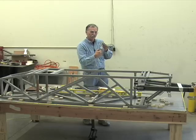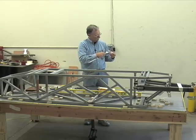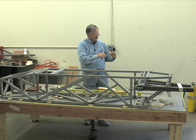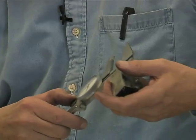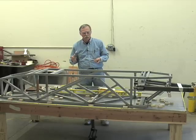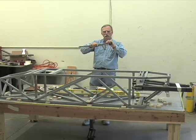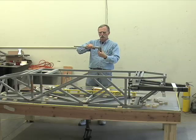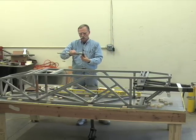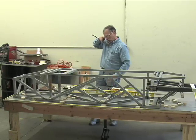So the idea of that is 0.906 inch. If you pull this back and try to read that burr, there's a difference: 0.903. There's a difference in the reading because of the edge burr. So be aware of these relief cuts on these jaws. This is a caliper. It's good for accuracy plus or minus 1/1000th of an inch.